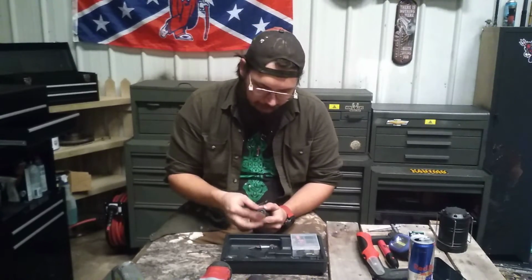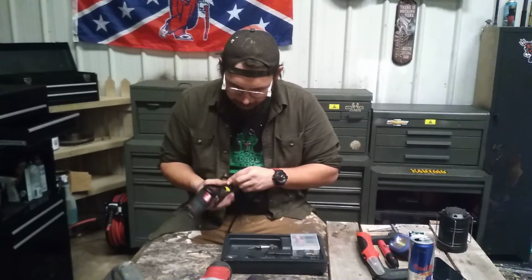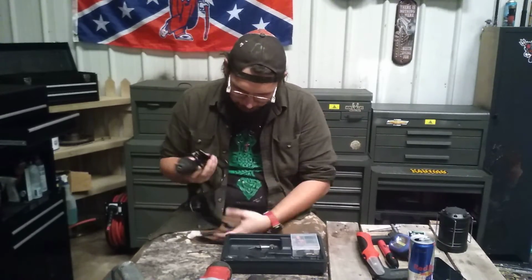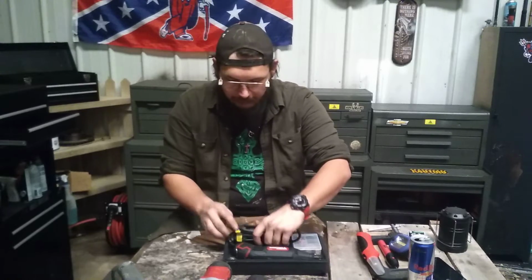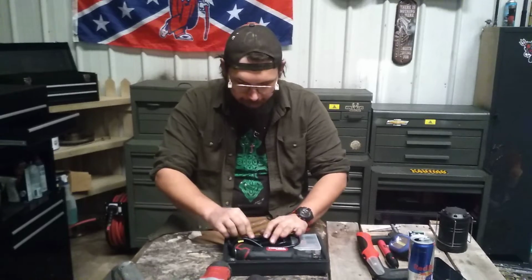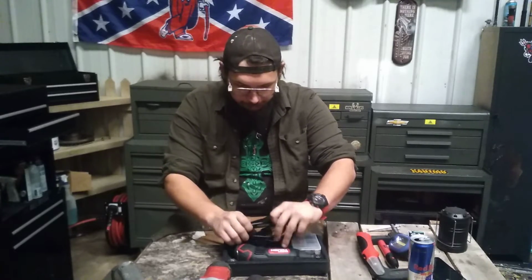And honestly, like I said, this thing is a lifesaver in so many different ways, especially when it comes to cleaning and just simple stuff like that. And even if you have to cut off a bolt, yes, you will wear through a lot of this to cut off bolts with this, but if you got a stubborn bolt and nut that won't come loose and it's in a tight area that your grinder just won't fit in, definitely would suggest a rotary tool.